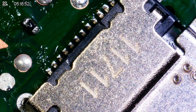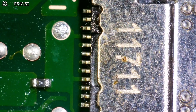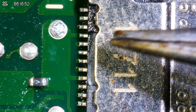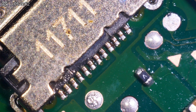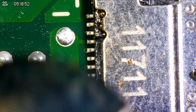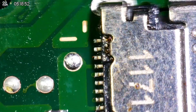Here we go — here's what it all boils down to. I was waiting for the pins to go a shiny silver colour but they never did. Then I started seeing the plastic melt — I obviously don't want to melt the plastic inside the charger. I don't think any of these pins are solid whatsoever. I'm going to reapply flux and go again. I'm going to increase the airflow on the hot air station — it's on five now. Plastic keeps melting. This is really, really tough.